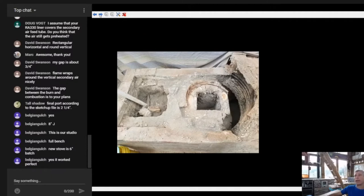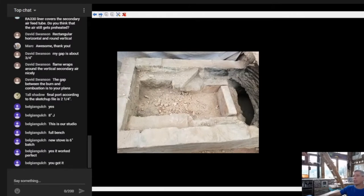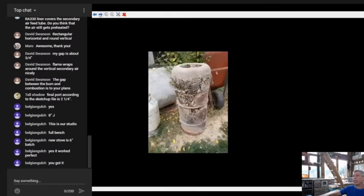That's something everyone should keep in mind: if you're building a stove and you have a large radiating surface, you can adjust how fast it puts heat into your space by covering some of that metal with cob. A little more deconstruction photos getting into that J - here's the old riser.